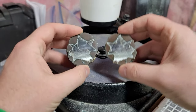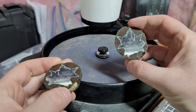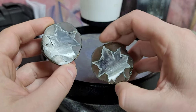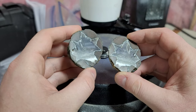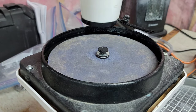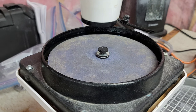We finished the 220 disc and things are looking pretty good — I'm starting to see a little bit of a shine. I can tell right off the bat that the rhyolite on the outside is not going to polish as well as the silica in the middle of the Thunder Egg, which I think is pretty typical with these. One tip: when you're done with each disc, let it spin at full speed without water being added to dry the disc out — you don't want to put it away wet. Let it go for about a minute at full speed and it dries right out. The next disc for us is 325.